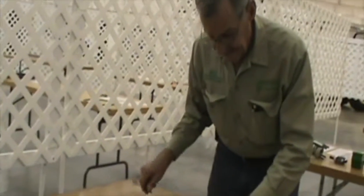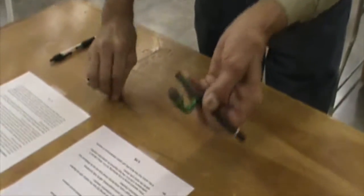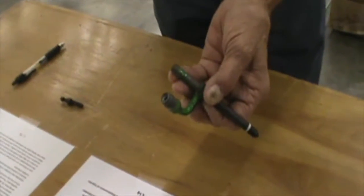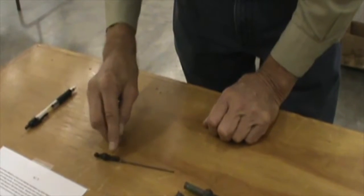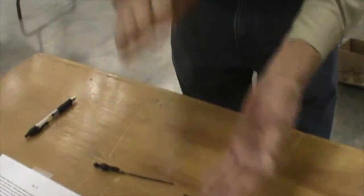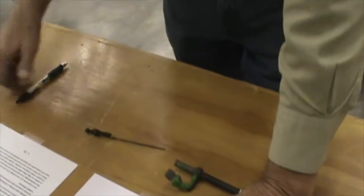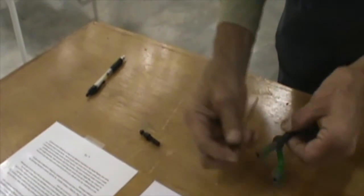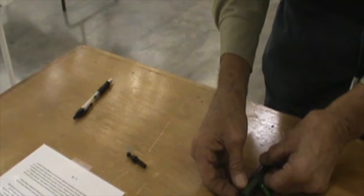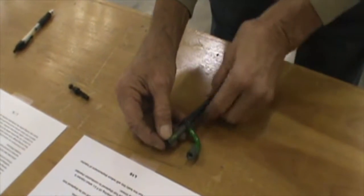This is what's commonly described as a pencil injector — notice it does look like a pencil. You have your injector housing, and this is actually your plunger that goes down into your housing. You've got your spring, which is adjustable to adjust how much pressure it takes to open it up. Question number one: if a return spring fails in the injector, it will not displace any fuel into the combustion chamber. If this spring were to fail, it would allow this to be freely opened. Your fuel's coming in, this would freely open and it would dump fuel. So that's false.